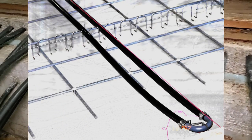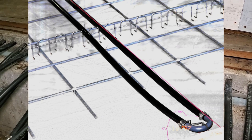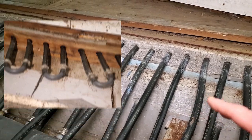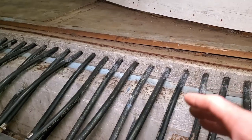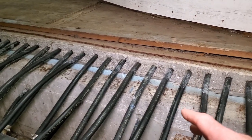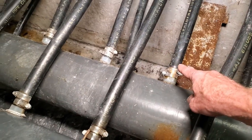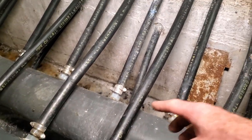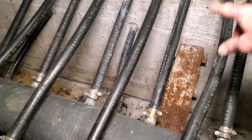Your concrete cooling slab not only contains your cooling tubes — it contains rebar to hold the cooling tubes in place. Where the return trench is, that piping is also embedded in the concrete. At the end where the tubes meet there's a little U-connector that completes the circuit, so to say, in the flow of brine going through the concrete tubes.